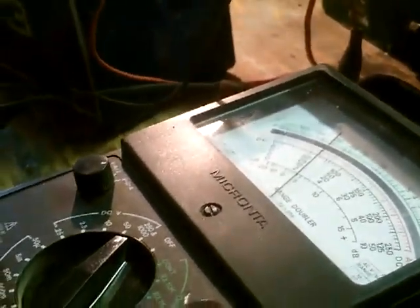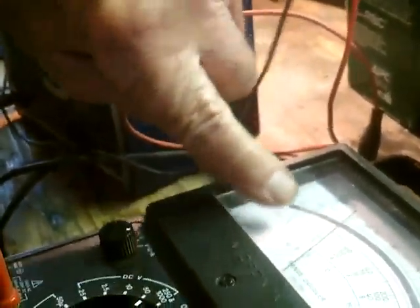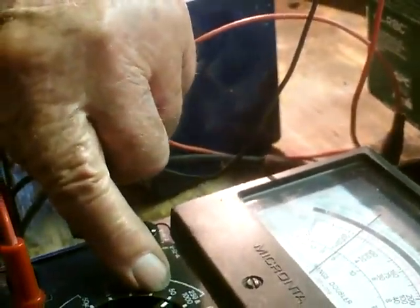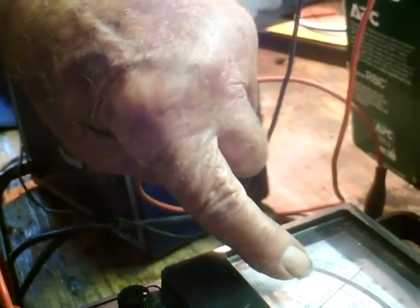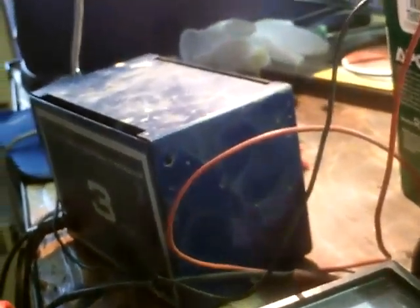And that's about 14 volts. Where is that? That would be here. We're on the 50 scale. The 50 scale is the first scale up. See 50 there? If you look around, that's 10. And that middle thing is 15. So it's just under that long bar, which would be 14 volts. I see. Okay.